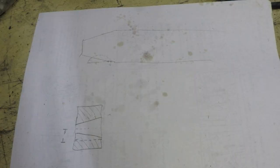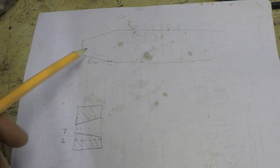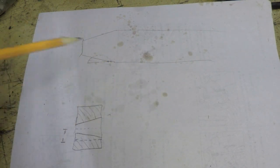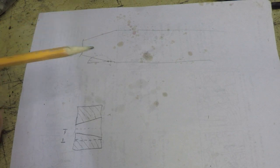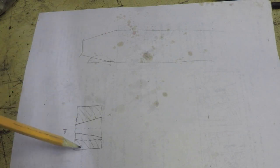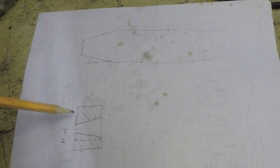so I'm not really too worried about that. I've got one other problem, or concern I should say, regarding getting ready to cut this woodruff key slot, and I figured I'd better illustrate it, because I might not do a very good job of explaining myself. But here's my concern. This is a cross section of the bushing in the steering wheel, and there's the tapered hole. I've exaggerated it so that I can better illustrate the problem.